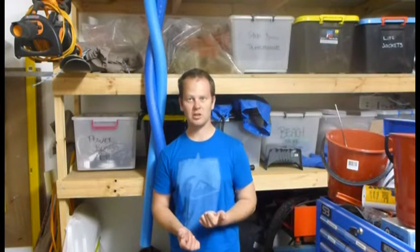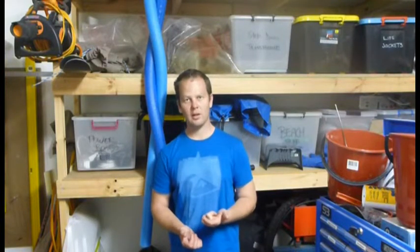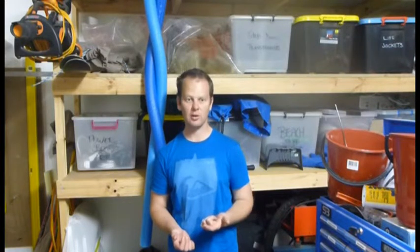From what I've seen, the way a cable fails certification is you remove too many twists in the back of the jack, or the jack itself is not a CAT6 or whatever specification you're trying to have the cable certified to.